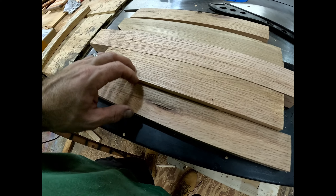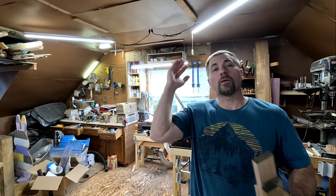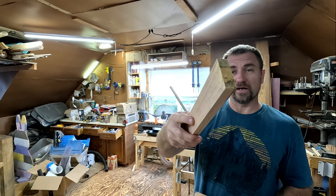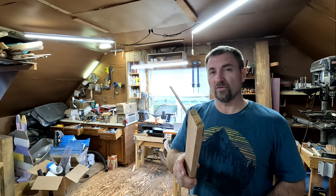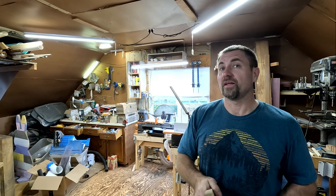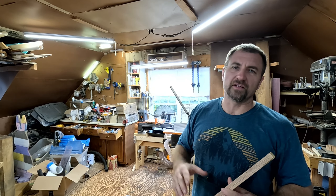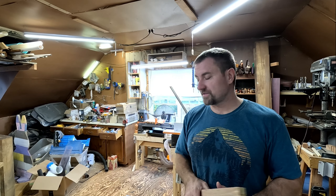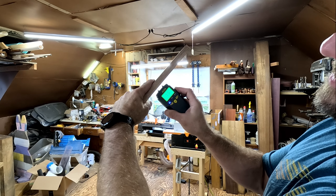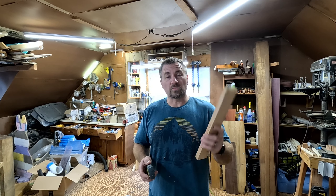Some of it's short, some long, and there are a few bug holes I can fill in. Welcome back into the shop — it's been a few days. I milled these down the other day and checked the moisture level: way too high. So I borrowed the oven — don't tell my wife — and put these in at about 220-230°F for an hour, turned it off, let it slowly cool down. I did that twice and now I'm down to 7.5%, which is sort of acceptable. Kind of wish it was a little lower but I'm running out of time.